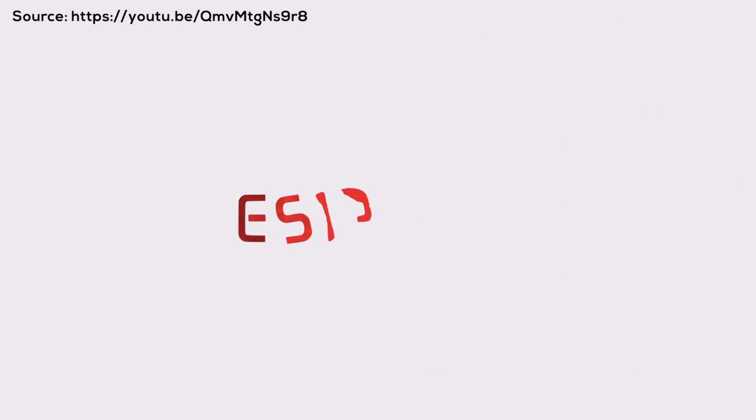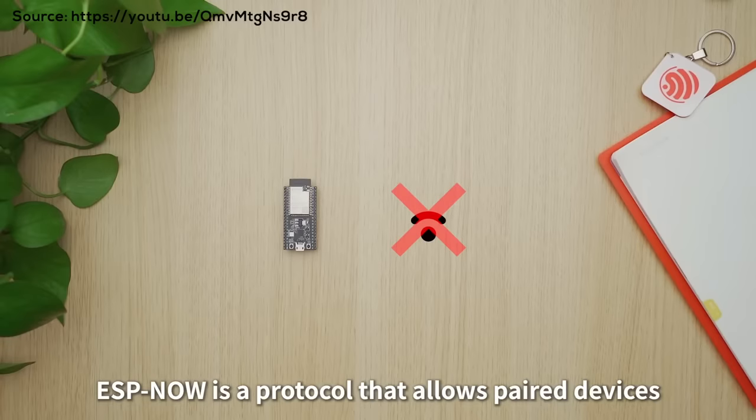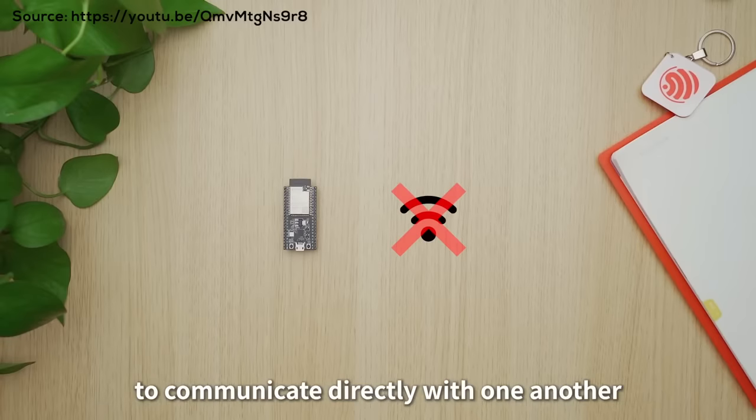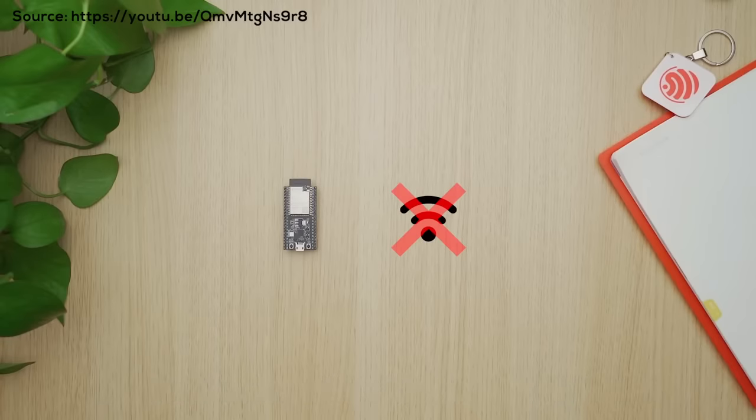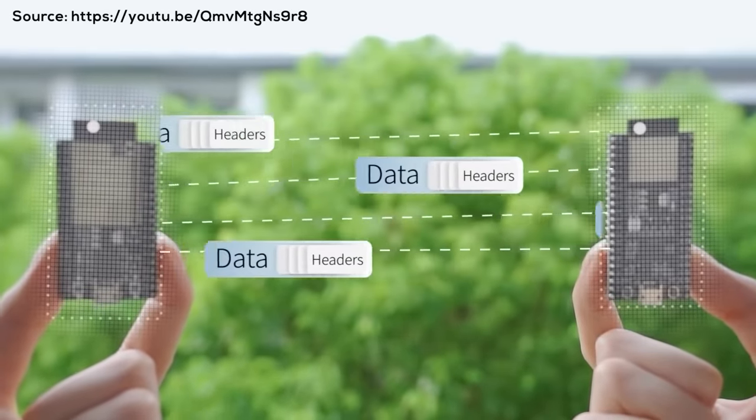The best way to use Picoclick IoT buttons is to set them up as ESP-NOW devices. ESP-NOW is a Wi-Fi protocol developed by Espressif itself, which focuses on a small payload and an access-point-less structure, which makes the complete communication ultra fast.